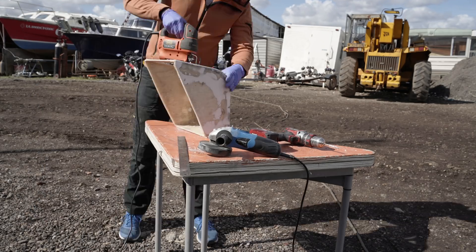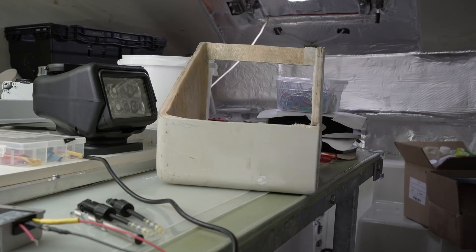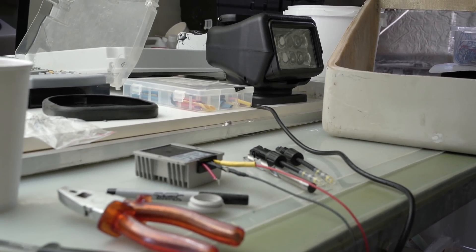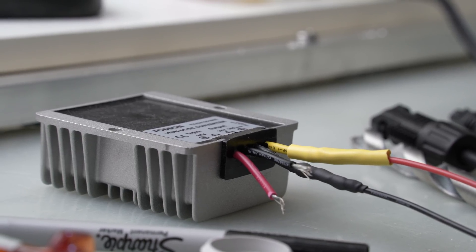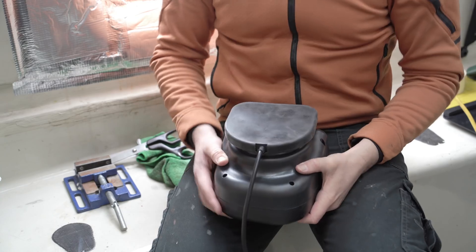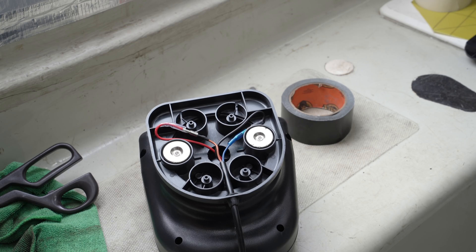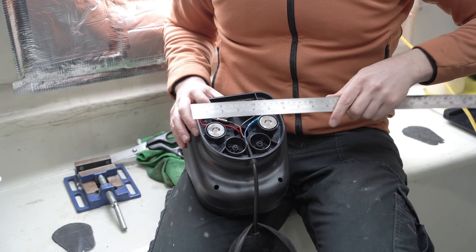Novice Alan fans amongst you may have thought I'd be unveiling this episode. You have lots to learn. Let's take a quick look at the electrics link-up I am preparing for the searchlight. It's 12 volts, sadly, and my deck supply is the normal boat voltage of 24 volts, so I'll need to step that down. No great drama, and the current draw for a 50 watt light is exceedingly low. There's no need for a premium buck converter, so this epoxy-potted unit will end up inside the housing. Yes, this is upside down - otherwise I'd have to take the sticker off and reverse it, and life's too short. The searchlight came with nice easy friction connectors that run to the car charger plug, simple to unplug and ready for being wired up into my system. Those large magnets will come in handy too.